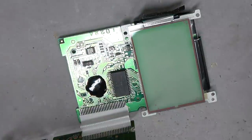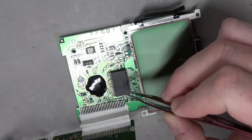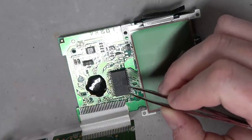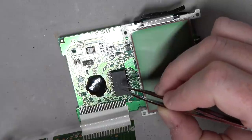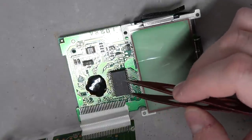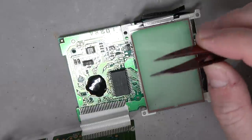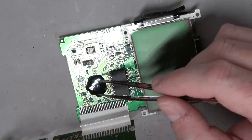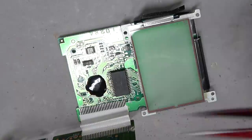And it doesn't have a window of any kind, so you can buy these where it's a one-time flash. You put it in a programmer, you flash it once, and then you can never flash it again. That's pretty common, and it's more affordable because you don't have the window and whatnot, which raises the price. So it's actually looking like a pretty simple system. And God only knows what's under that glop top.